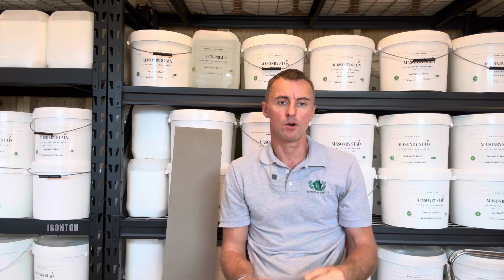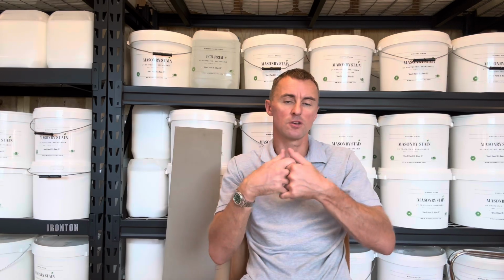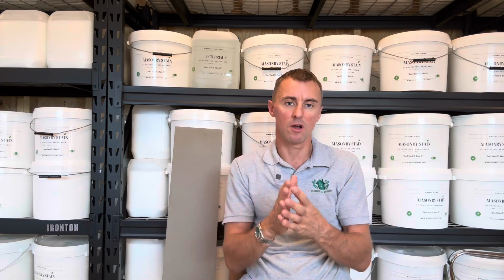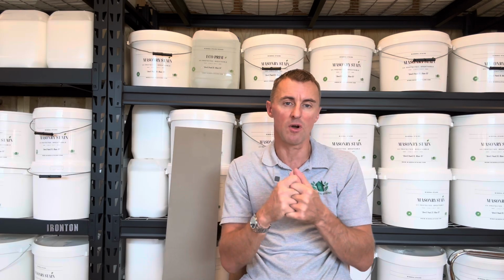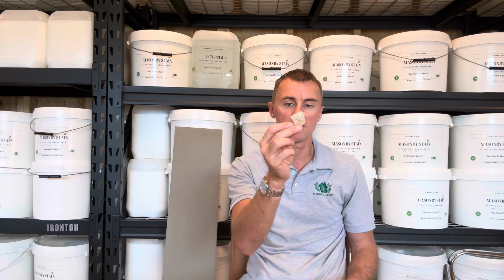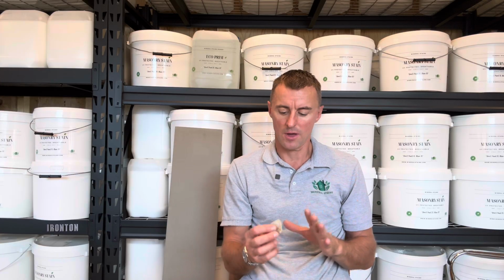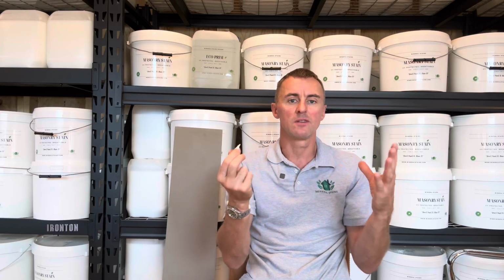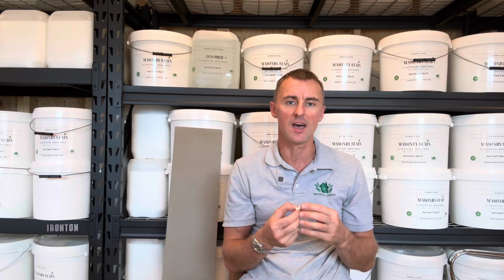in theory. Now, per German and European standards, to have a true silicate, we're allowed up to 4% acrylic. So the acrylic is going to actually help bind the color with the Waterglass and put everything else together. Without the 3 to 4% of acrylic in the product, the Waterglass could actually harden and turn to something like this. Now, the acrylic is so small in percentage that once you actually apply your brick or masonry stain, it almost disperses. So it's not really a factor where, oh, I have acrylic. That's not the case here.